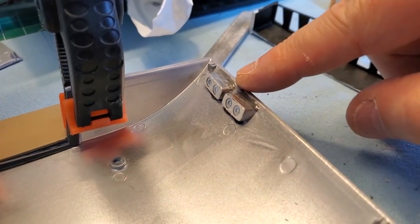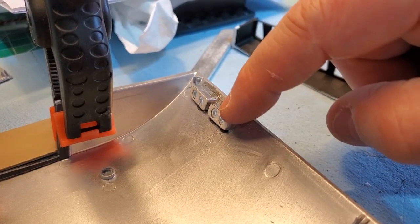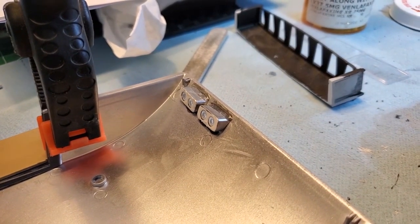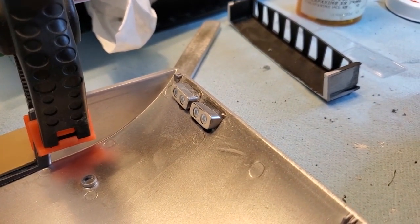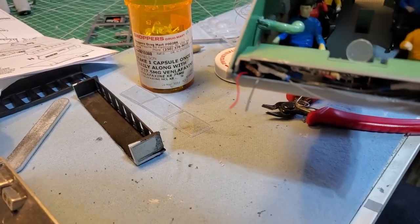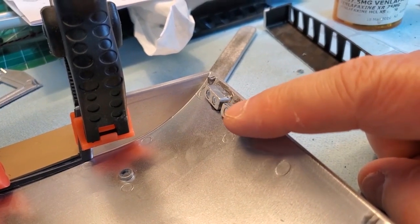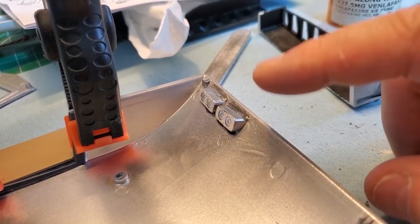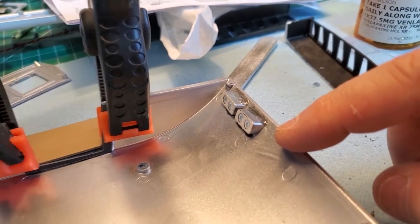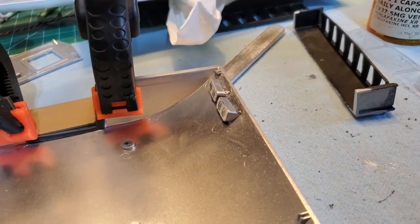And the fronts up here are pot lights, so I'm going to have those SMDs on here, 4 small SMDs on there, probably with like a 100 ohm resistor, so those have to be connected as well. Actually, I think I'm going to have those on a separate switch, so I can turn them on separately from the rest of the ship. Yeah, so I'll have 3 switches for the impulse engines, for the main lighting, and for the pot lights here. Yeah, I like that.